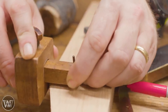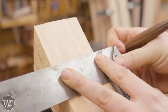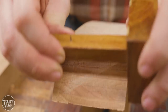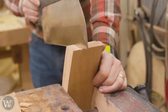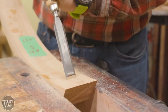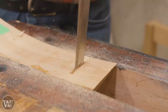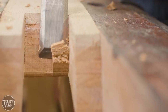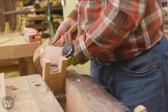Now we need to start working on the joinery between the arch and the leg structure. On the leg we have the lines drawn from where the arch intersects, and we also need a bottom-out line where the arch bottoms out onto it. On the arch we need to cut in the bridle joint — this is a slot coming down either side that is the width of the thickness of the leg. Once we have that in place we can cut down on either side, the same thickness as the leg piece that will be intersecting. These will double-bridle-joint into each other. To chop it out we need to be very careful working on the end of the piece — clamp it down tightly and pound it down a little at a time until we can chop it out and clean the surface back to those lines.